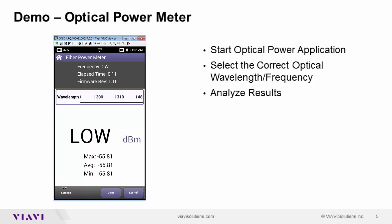As I said before, arrowing over on the screen we can select many different frequencies. Auto wavelength helps me to automatically find a particular wavelength. We'll choose 1310, a typical CATV frequency used in the return path. We can clear to reset everything — it's already at minus 54 — then we can shoot some light in here and see the transition in light level. The average and maximum light level will take a few seconds for the laser to settle down. Clearly we can see how easy it is to read different light levels at different unique frequencies. We'll turn our laser off.